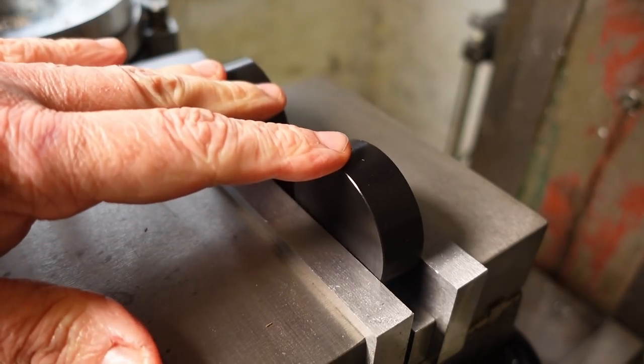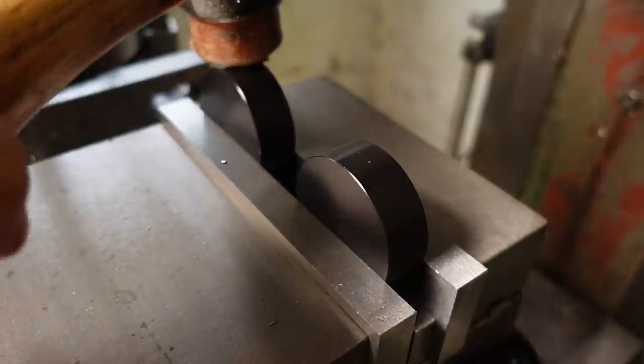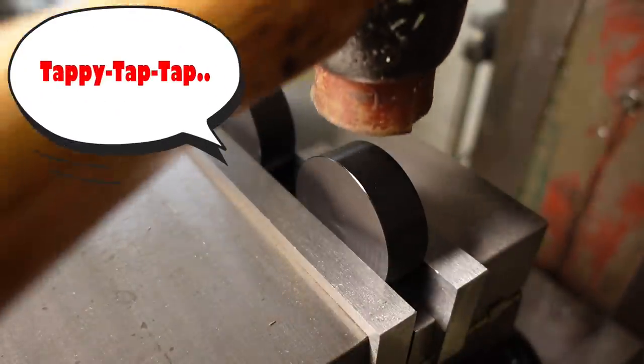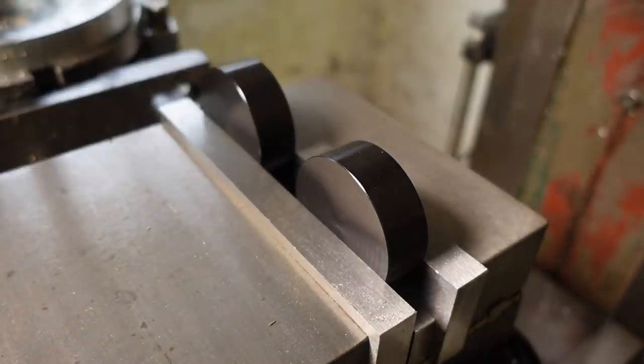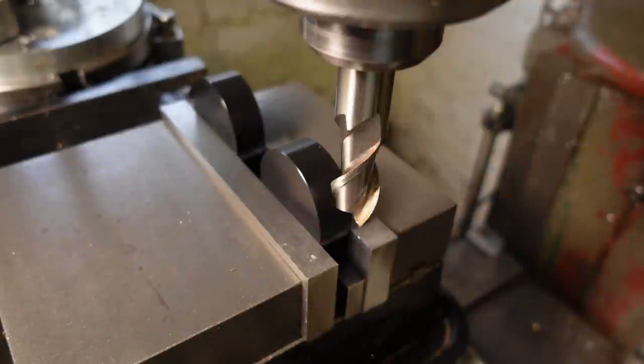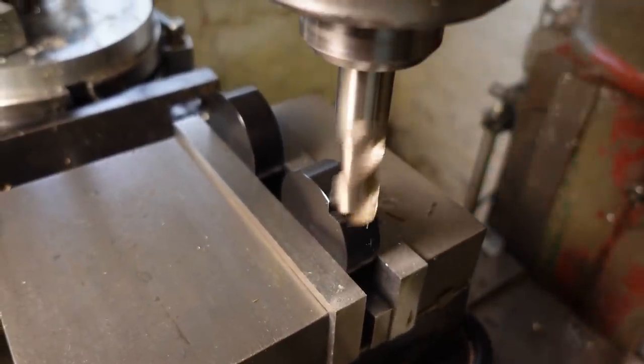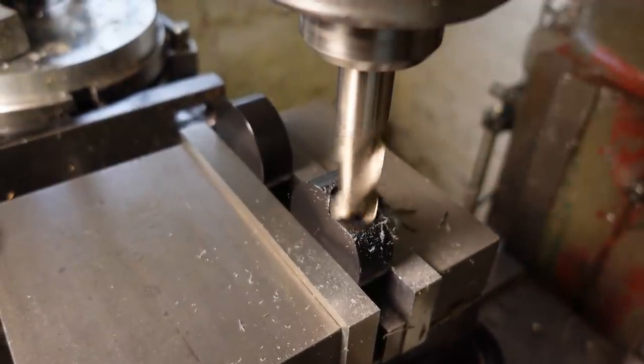Delrin's a reasonable choice as the clamps are tiny compared with a wavelength, so dielectric losses and loading are negligible. And fixing GRP bracing tubes to Delrin is simple. Metal clamps would be much more difficult to connect without causing stress points and would mean conductive material extending some way into the electric field of the antenna. There are better plastics for this, but I had some Delrin in stock.